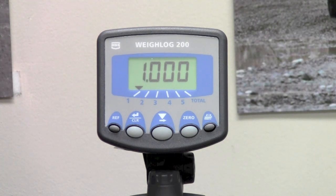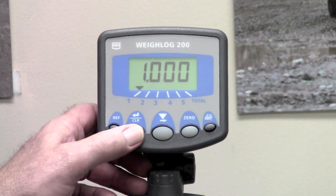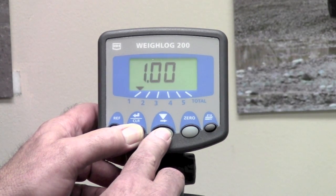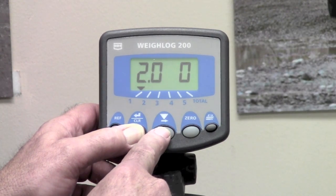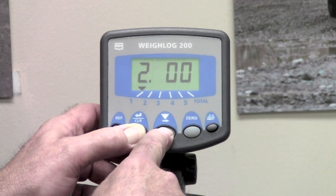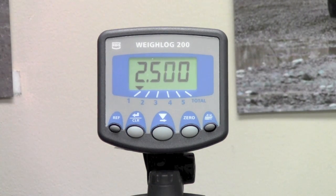In this particular case we do have the head unit set to read in tons. It's telling us that our known load we're going to put into the bucket is one ton. If it is not one ton — in this particular case we're going to change it to 2.5 ton. Remember when we were talking about the CalF factor: you get the digits flashing, then press and hold the center key and it increments up. So we've told it that our load is going to be 2.5 ton.